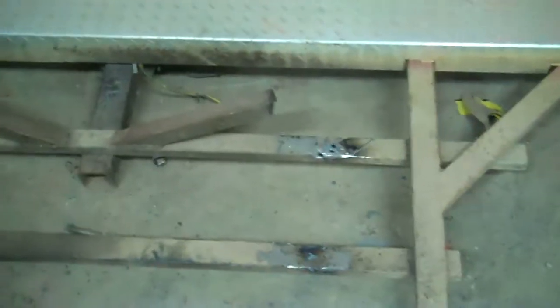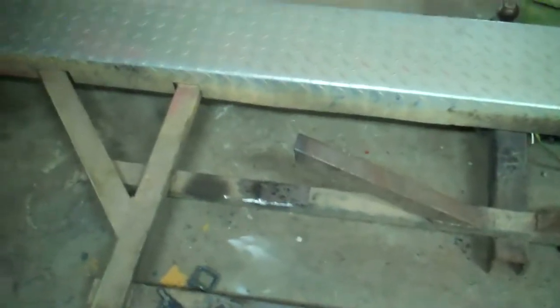Okay, there's the bumper trim down. If I don't have this right, I'm just going to remove it because I have new stuff to weld in place of that, so it's not exactly where I want it. I'll torch it out of there. Just put some new stuff in there. I got it ground down, about 6-8 inches right there and right there and right there, so I can line it up any way I like. And then we'll tack weld it and get it going.